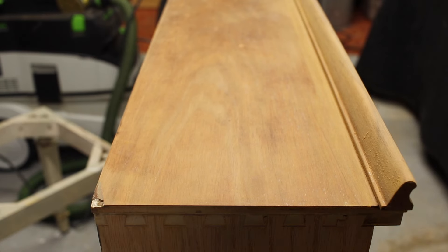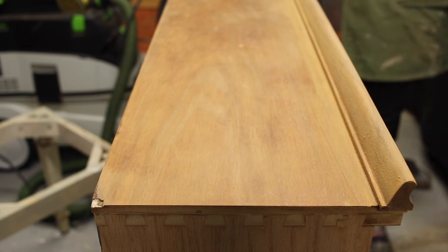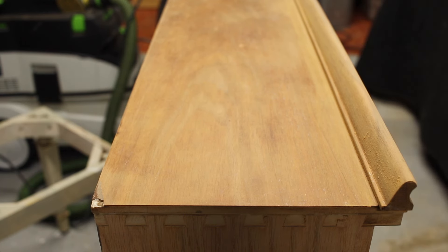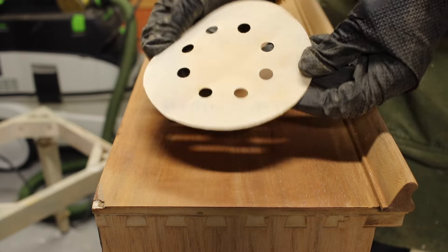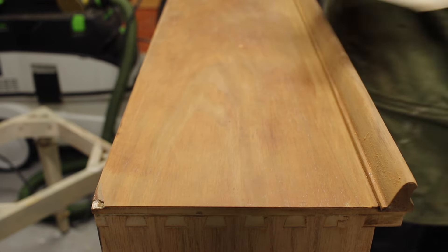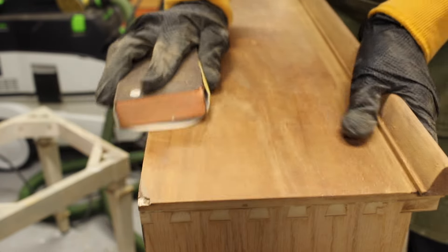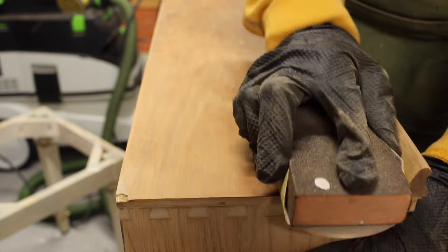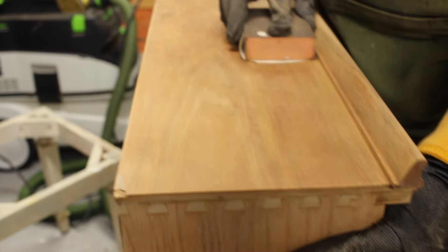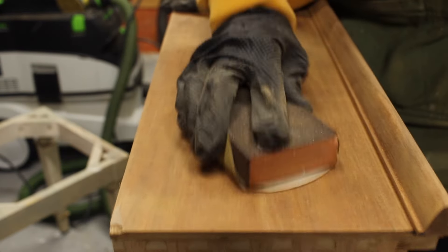I finished sanding the solid walnut poles with 120 grit and got most of the finish off — they're looking good. Now I'm moving on to 150 grit for the drawer fronts. I don't like to use 120 because it can be a little bit aggressive on veneer. I'm hand sanding right now so it's pretty gentle on the veneer, and this veneer is thick so I'm not worried about sanding through anything. I do have to fix that little missing piece of veneer on the corner, which I'll do a little later in the video.